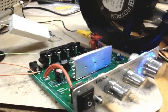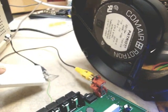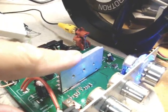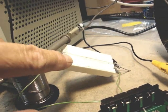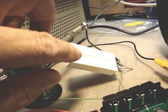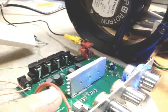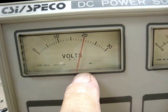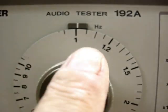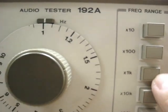Here's the amp hooked up. The heat sink is installed and a fan is cooling both the resistor and blowing across the heat sink. That's the four ohm load — two 20-watt resistors, and they are very hot right now. This has been running for about 10 minutes. I'm operating it at 20 volts, drawing about two and a half amps. The oscillator is set at one kilohertz.